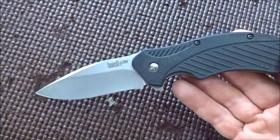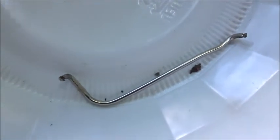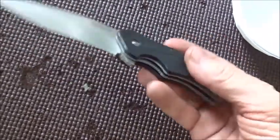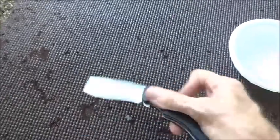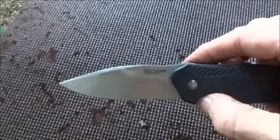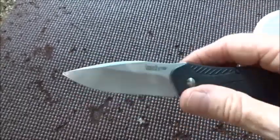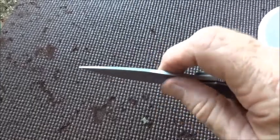What I did is I took it apart, took out the spring. I put it back together and it's just as sturdy as it was with the spring in there. Now all I got to do is flick it out. I got to adjust that screw here a little bit, take some tension off — I'm going to put some Loctite on it to keep it right where I want it. And there's no blade play side to side.